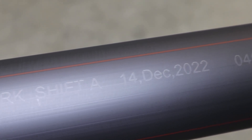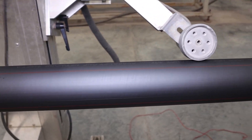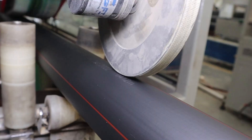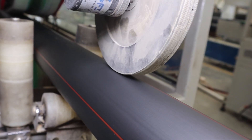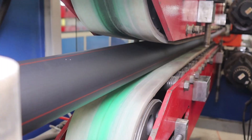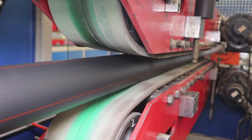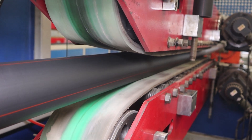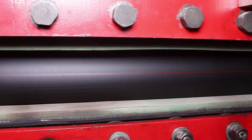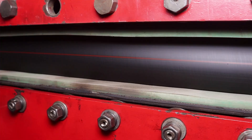Next, the fibers are tested for quality and performance. Every fiber undergoes a process called attenuation testing, where the amount of light loss is measured. This step ensures that the fiber can transmit data over long distances without significant signal degradation. If any fiber fails the test, it's discarded or corrected before continuing. At this point, we have a strand of optical fiber that's ready to be assembled into a cable.